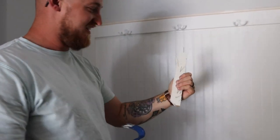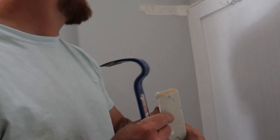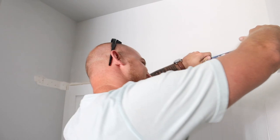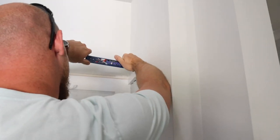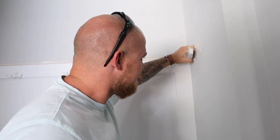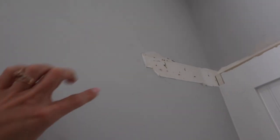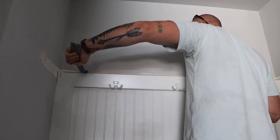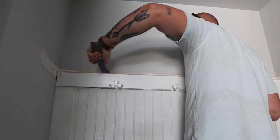We're finding out you definitely used a lot of caulking — and a lot of nails too. This is not going anywhere. Well the paint is going anyway, so we're going to have to sand it. I figured as much because of how much caulking they added. I'll have to come in here, fill in those holes, and sand them down.